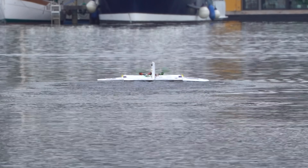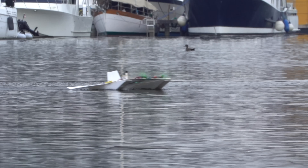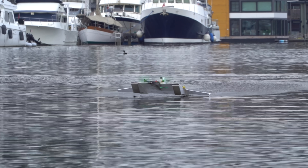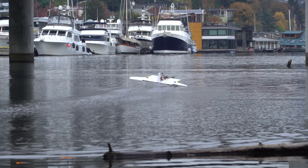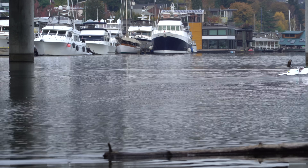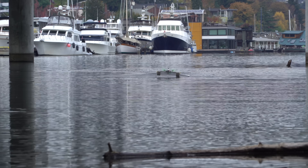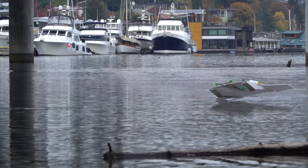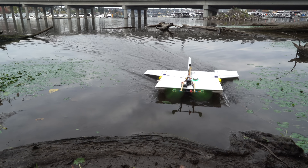It's over-tuned — the wands have too much control. It seems to work well at lower speeds. Right there, that's flying — it's not touching the water except for the wands. It's getting a little squirrely. I keep trying to give it little bits of elevator and aileron input, but there is no elevator or aileron control right now — it's just rudder only. Let's try and adjust the tuning a little bit.